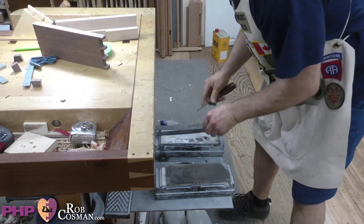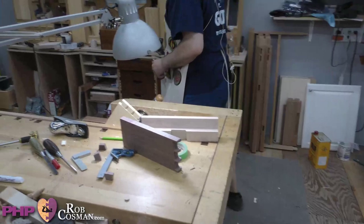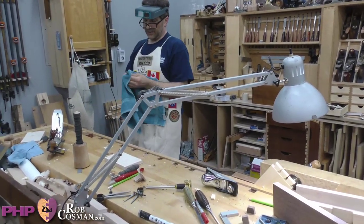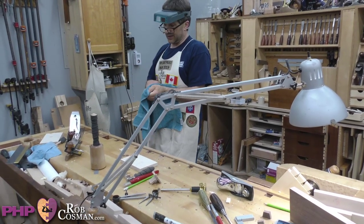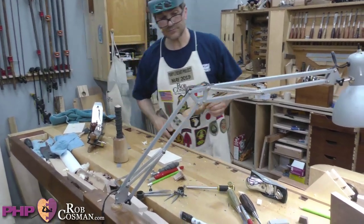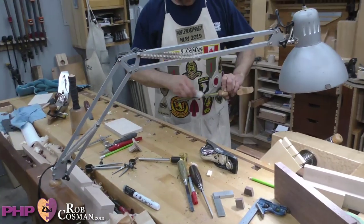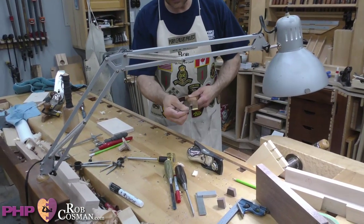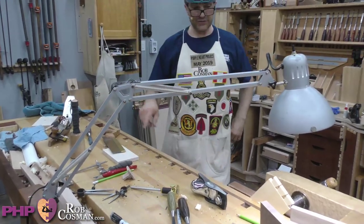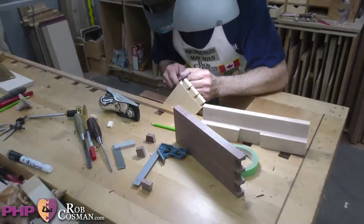Do you ever use wax or light oil on your saws? You put oil on them when you sand them, right? Yeah. No, sometimes. I mean, if you're down to your third sharpening and you haven't reset them, it may be a little bit tight. And what you can do, Alan Peters used to do this, a couple of cuts will warm up your blade. Just run your wax like this, and then just use your fingers to do that, and it'll slide right through the wood. Now, I'm not a huge fan of doing that because you're waxing what is going to be your glue surface. So you want to be careful.